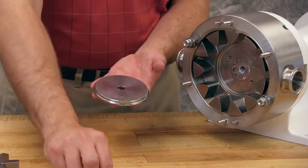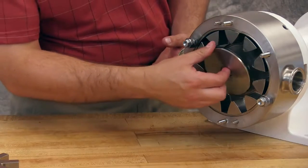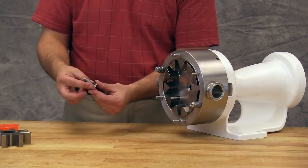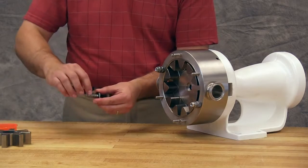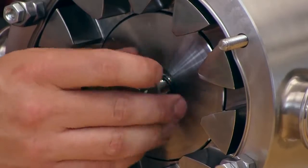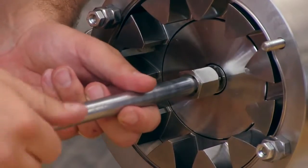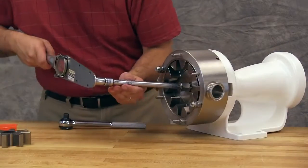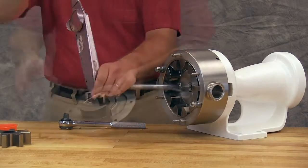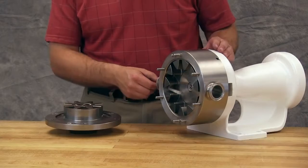Place the rotor retainer cap O-ring onto the rotor retainer cap and install onto the rotor. Apply food grade anti-seize to the rotor retainer and install the retainer to secure the rotor. Place a length of plastic bar through the port opening between the rotor teeth to keep the shaft from turning. Use a torque wrench to tighten the rotor retainer to the value shown in the TSM using the retainer socket tool. Place the idler onto the idler pin. Remove the plastic bar.